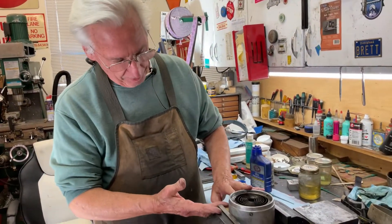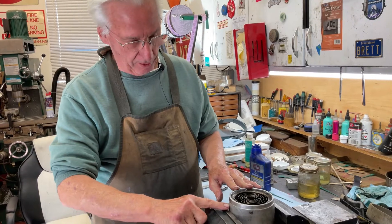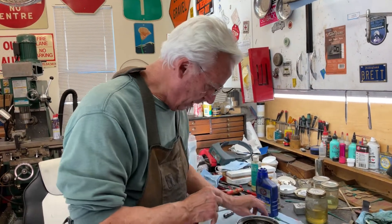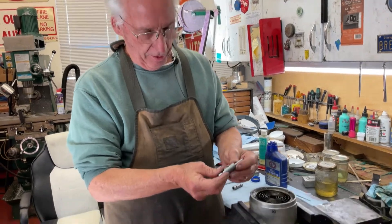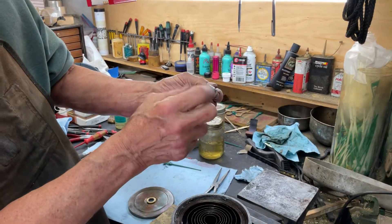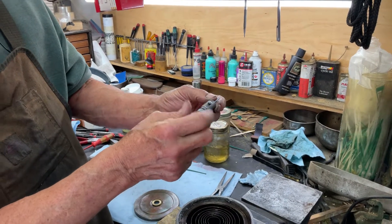What I'm going to talk about is the spring barrel. We've got both of them packed and I have a little punch mark. Remember the left-handed screw we put in? So we have this piece. If we go clockwise, it unscrews. We go counterclockwise, it goes in.